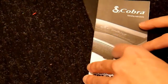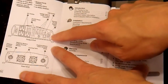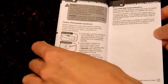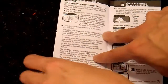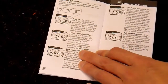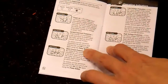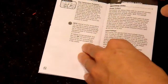Let's take a quick look at the manual. It's a pretty small manual — just a few fold-out pages. The picture in the manual matches the box, but it does not match the actual product. Always a bad sign. The manual does mention that certain appliances will not work on modified sine wave, and mentions some basics of the difference between modified sine and pure sine — it's good that they mention that. Apparently the display toggles between output power and input voltage. Current overload protection is separate from short circuit protection, which is nice — it'll tell you if something is wired up wrong. Low and high input voltage notification is also included.